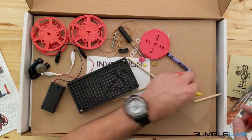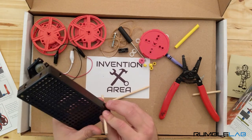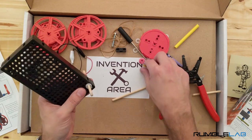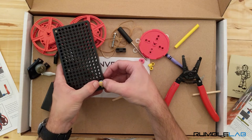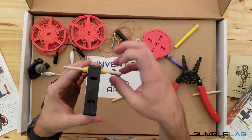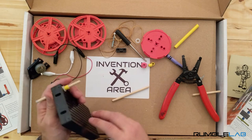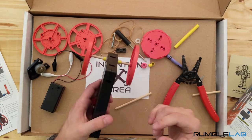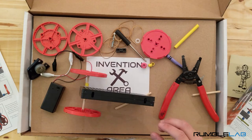For the black plate, the four corner holes will not allow a dowel to rotate — we want this dowel to rotate so the wheels can spin. So we're going to install it next to one of those holes. With the dowel in place, slip a washer on, then slip your slide stop on, and repeat this on the other side. Now go ahead and install the wheel — just push one on each side of the dowel. After pushing the wheels on, the slide stop may have moved, so you may have to readjust it. Then make sure the wheel can rotate freely — wiggle it around and adjust it as we learned in foundations.